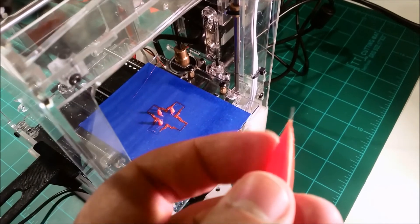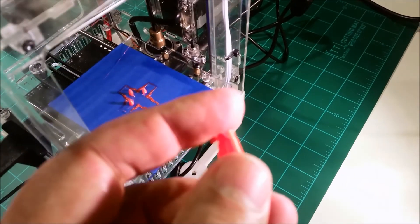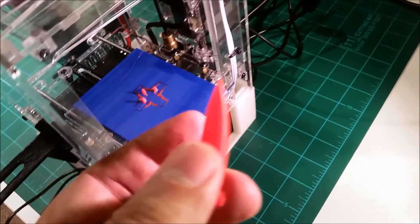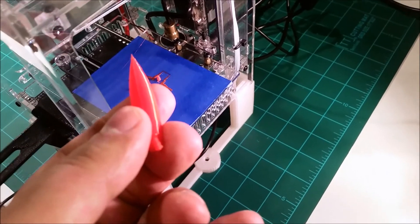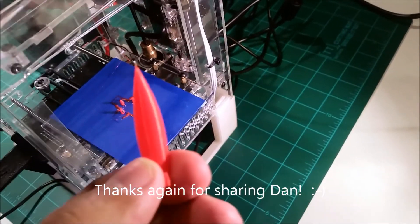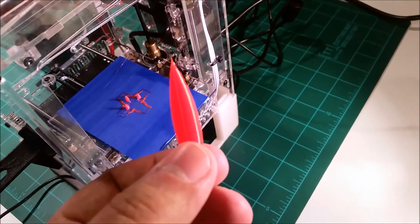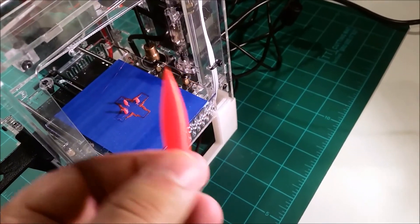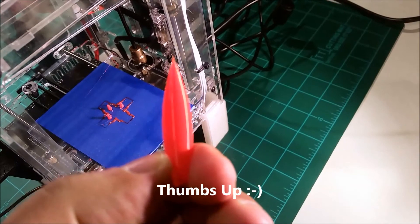The top isn't too bad — it's about the same as the last one I printed at 0.1 layer height. It's a little odd at the bottom, but it pretty much did what it was supposed to do as a vase. I'll have to try this on a couple more models. I just wanted to experiment with this and share what Dan told me about being able to print vase-type structures with Cura, and associate that with Octoprint. Now I have a vase-type profile loaded into Octoprint, so if I want to print something like that, I can.